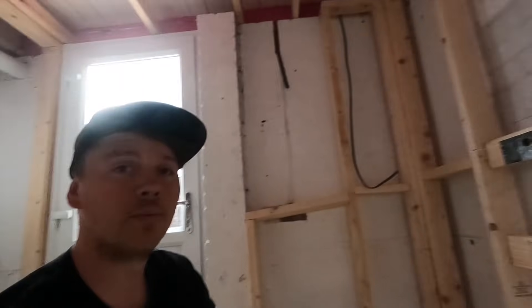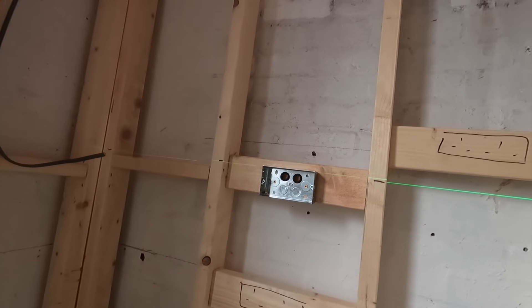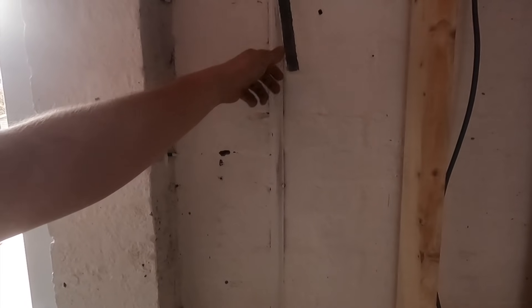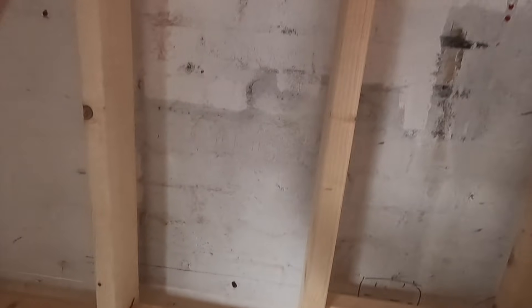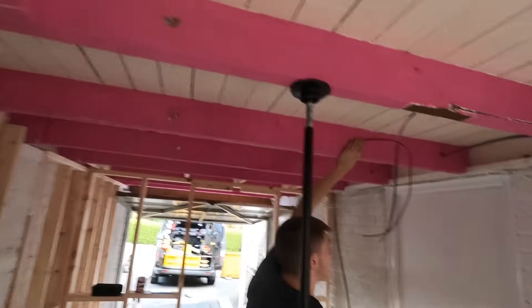The sockets are done and I can get them fed around and clipped to the wall - the celotex going in means they'll be well enough away from it. These bricks are solid so I don't know how anyone got nails in before. We might just put some all-round band and slide the cables down some black conduit so they're safe and secure. Adam's just getting on with the downlights - he's marked out five.